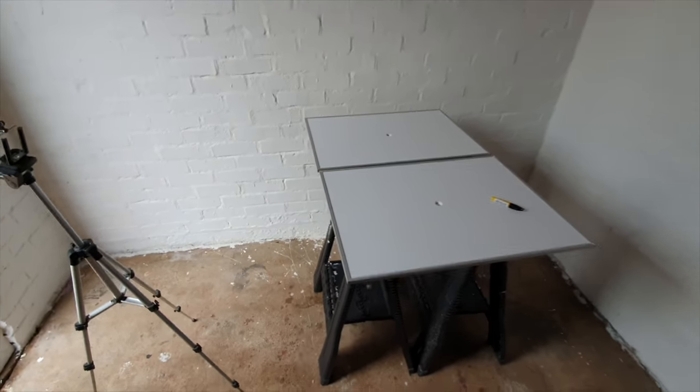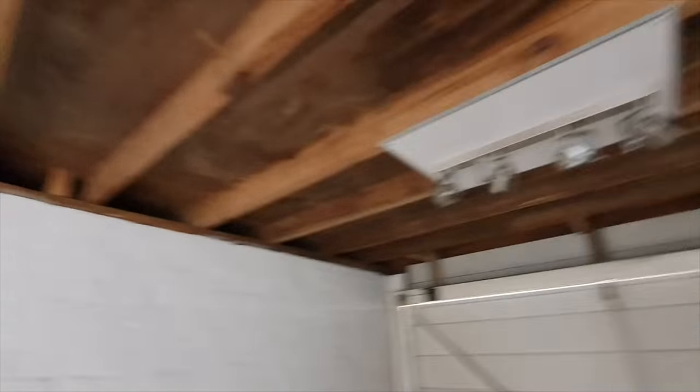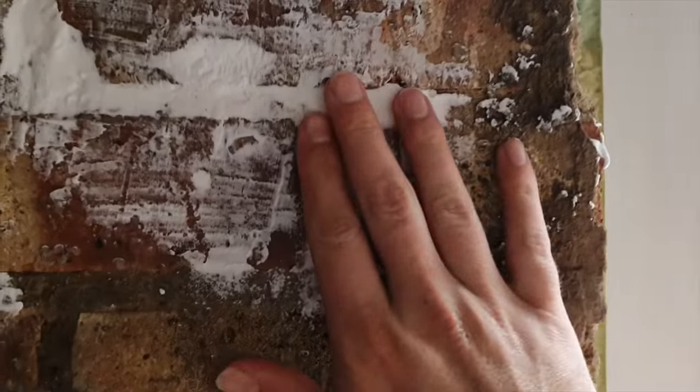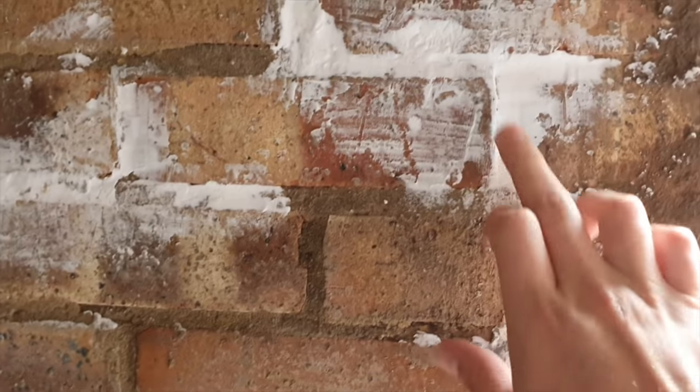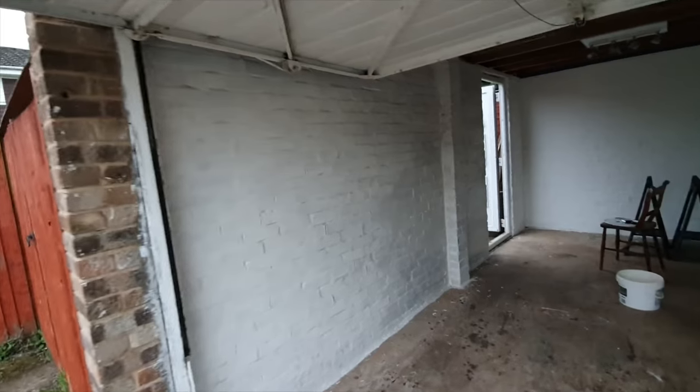I was planning on gluing these side bits on, but actually they're such a tight fit I think I'm going to leave them as they are. They've come out pretty nicely — they'll look better with bulbs and when the electric's on, but I think they don't look half bad. Kind of cool and stylised. I've also marked out the power points for tomorrow so when the sparky gets here he can just crack on and install those on the wall. In the meantime, I'm going to get started on the first base coat on this wall. In regards to the comparison between the polyfiller and the decorator's cork, I'd actually probably recommend going with the polyfiller — it seems to have done a better job, feels a lot more secure, and is probably going to be better paintable. For anyone who wants to do it, just get a normal polyfiller suitable for brick and masonry. Last wall, base coat, all done — I literally used the last little bit of the bucket on that. It was by far the hardest wall so far: so mangled, so porous, it just soaked up the paint. I only had enough for one coat so I'm going to try to do two top coats and hope that will cover it.